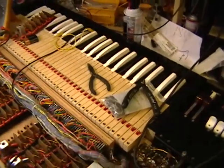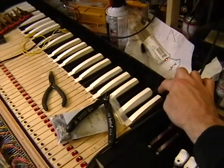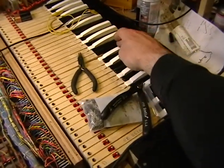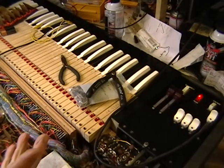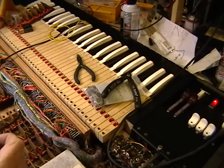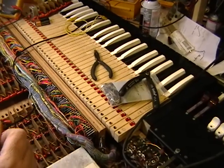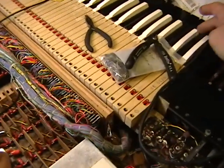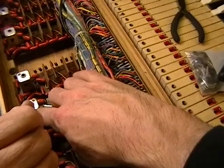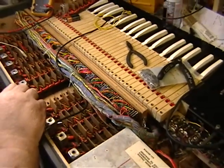Back in business! That's a concept — there's an example for you. The transistor reads good on the meter, and it will work at nine volts but it won't work at six. Something has drastically gone wrong with its beta over the years. They were nice enough to mark both of them. We're going to take these tired beasts and throw them in the garbage.